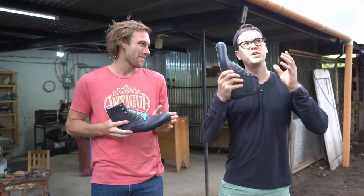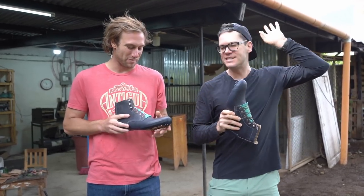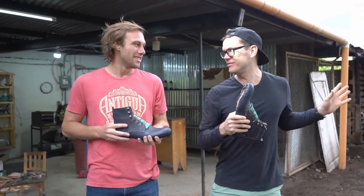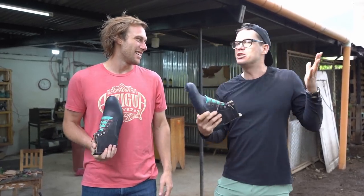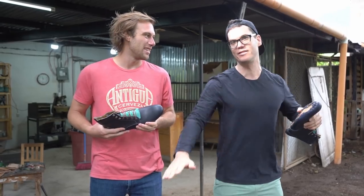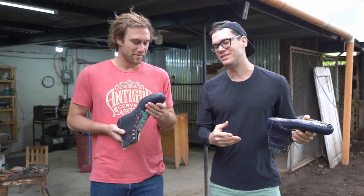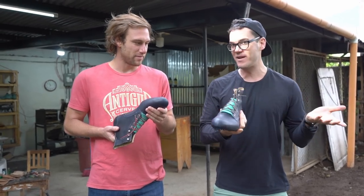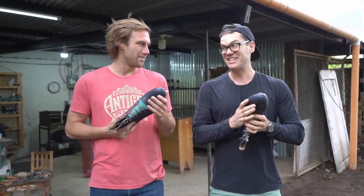It turns out that to use a Goodyear welt machine, although it's much, much faster than hand welting, it's a skill that I can't just pick up after a few minutes of teaching. Even if I tried, there's an extremely high chance that I would run the stitches the wrong way and destroy the entire thing. So instead, I'm doing the much more laborious hand welting, which a lot of people prefer for various reasons. That's the plan for today.